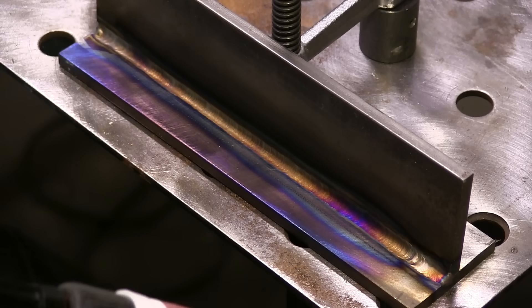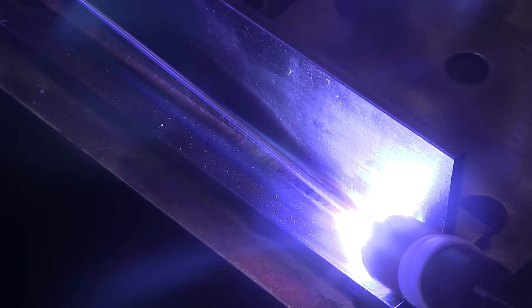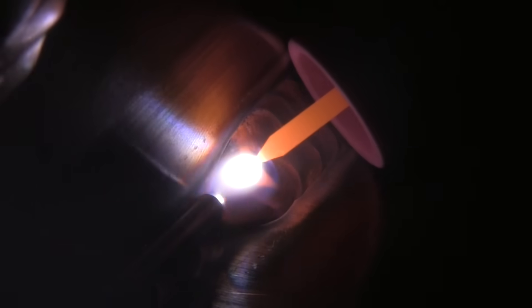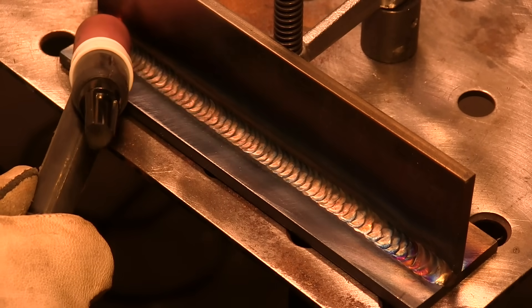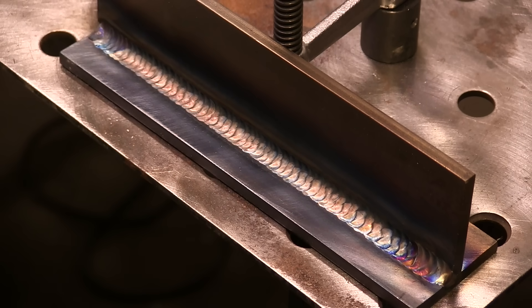That's the first pass. We're going to put another pass over that. You can see the little transition — about a half inch in I went ahead and welded freehand before starting to walk, and I've increased the filler metal size to 1/8 (3.2mm). It's all about selecting the right cup size and the right electrode extension to get the right angle. A rule of thumb: you don't want to go much farther than the inside diameter of your cup — though sometimes you do.